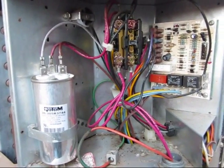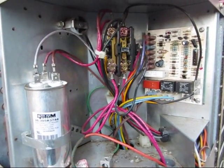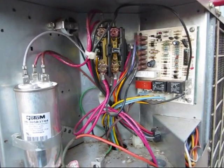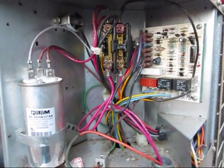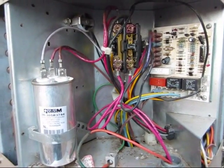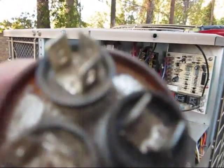So I hope that's all that's wrong with it. I was in the office and I heard a noise in the evaporator like when it switches from heat to cool or when it's in defrost — that kind of noise that something's wrong. I couldn't go out there right that second so I had one of my guys come back and they said it wasn't running. I was thinking at first it probably switched over to heat mode and tripped the pressure switch, but I opened it up and found that run cap looking like that, so it's a pretty good indication that's what it is.